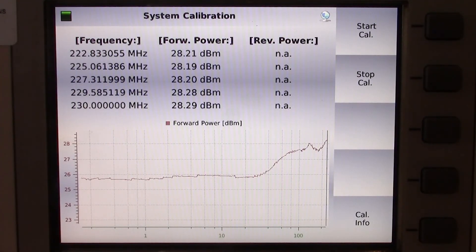We just received the message indicating that the system calibration was completed successfully. That should just about wrap it up for the calibration. When you are ready to conduct the test itself, all you need to do is remove those adapters and connect your EUT as well as select your modulation. We hope this video has been useful for how to implement coupling decoupling networks into conducted RF immunity testing for IEC 61000-4-6. Feel free to reach out to us if you're ever in need of any rental coupling decoupling networks or conducted RF test systems. Thank you.